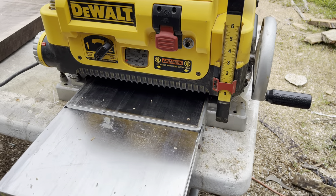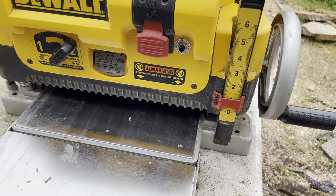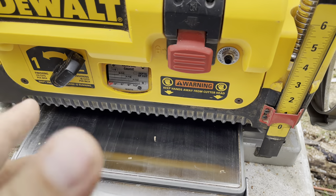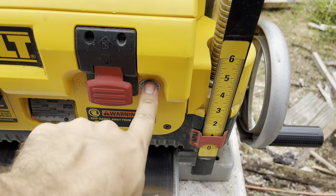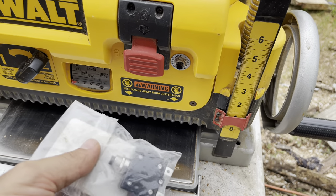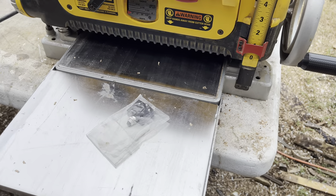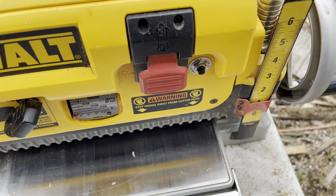The fix is a couple of things. First, you've got to replace this circuit breaker — that's the number one thing. If it's tripping constantly, it's just going to continue to trip. I'll show you how to do that. You can get the part on Amazon; I'll put a link below. It's not super expensive and it's fairly quick to replace. Second, you need to replace your blades. Even if you put a new breaker in, it's going to start tripping again over time if the blades are still dull. What I did was replace both, and I had no more issues.